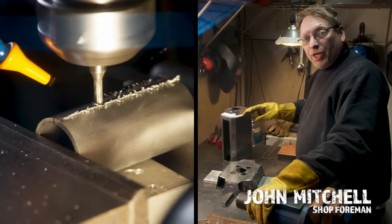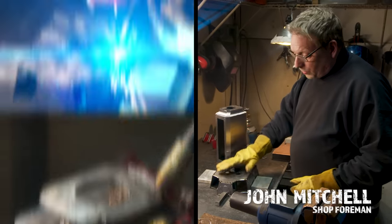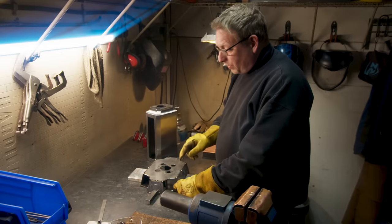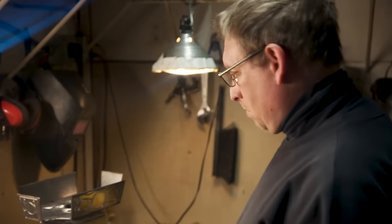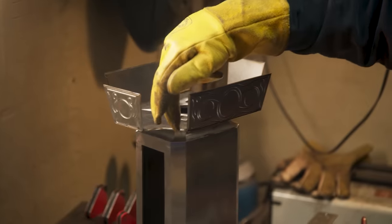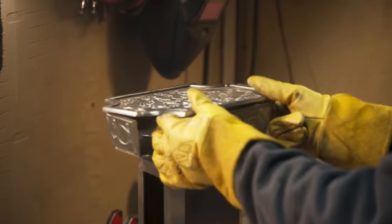After machining the parts for the scoop sections and welding them in place, with everything blended, Cary starts working on the top box. The sides are now tack welded onto the base plate. It fits nicely. Next they need to finish welding the sides on, fabricate the remaining pieces, get them all welded and blended, and then put the top on.